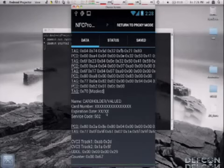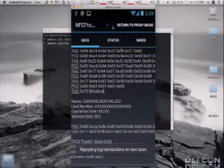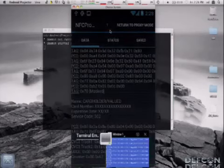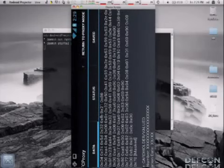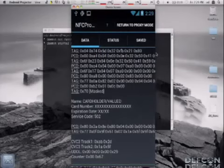If I long-click on this transaction and select Replay Tag, you'll see at the top it now says 'T' — indicating tag replay mode. We're going to replay the actual credit card to this reader now. Everyone look up front — the LEDs on this reader should light up and it'll beep. There — so I've just skimmed and replayed someone's credit card within a couple minutes. It's really simple: all I'm doing is replaying transactions; I don't need to know the protocol whatsoever.